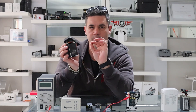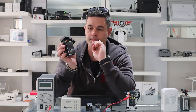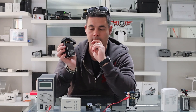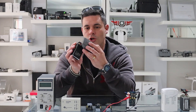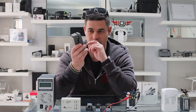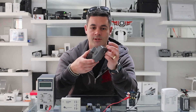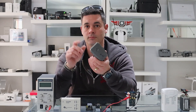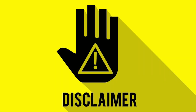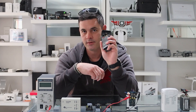It's got four cells. Two of the cells might be at zero voltage, and two of the other cells might be at 2.7 volts each. This battery's nominal charge is 17.4 to 17.6 volts. So what you need to do is open up the battery and check each cell with a multimeter.